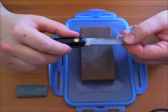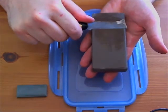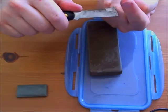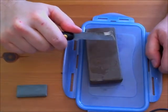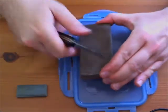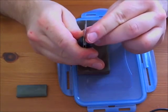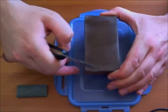But there's another disadvantage which not many references talk about. When you're sharpening, the friction of the knife against the stone will do two things. It will wear away metal, but softer metal is a little bit plastic in that it will tend to fold over and upwards to the side away from the stone. Now these little folds are what are called burrs. With the softer metal the burrs will tend to be bigger and harder to get rid of. That is a problem because as they get bigger they tend to be more flexible, and as they become flexible you can't control them and they don't cut as well. The actual edge underneath the burr will be rounder, which means you have less cutting power over your wood, your cane, or whatever you happen to be cutting.